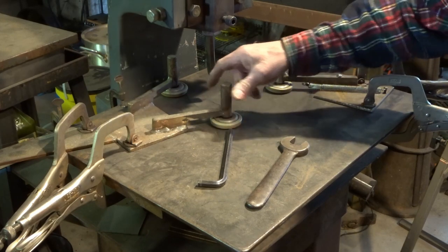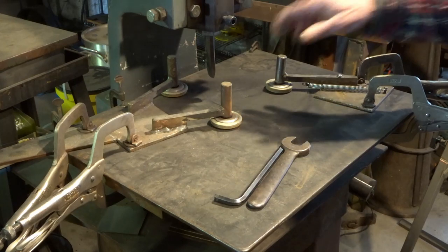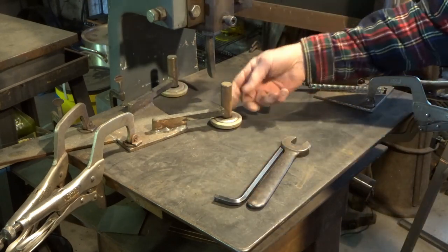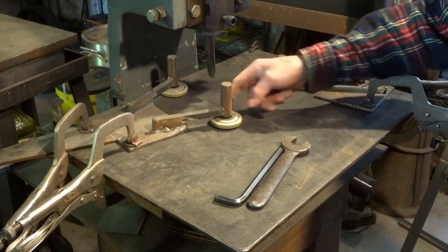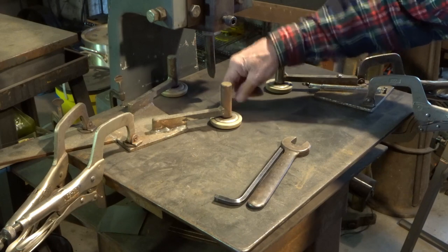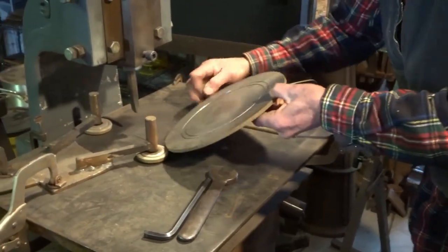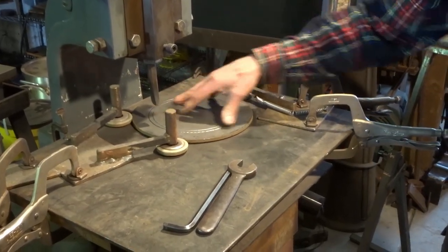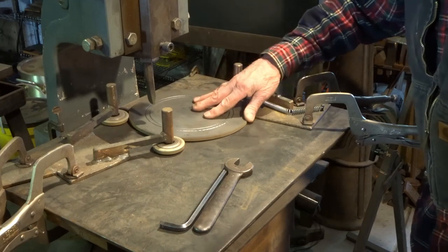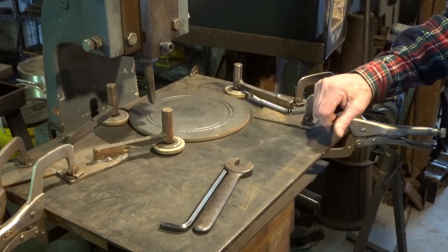These are off-feed rollers that came from a big warehouse — like 30 of these going across one roll, and they can put the brakes on it and make a box turn. That's how Amazon runs stuff around. I machined the place it pushes on through the center of the bearing, and made it so it was as close to the surface as I could but it would still spin easily. This one's basically just on a pivot with a spring, so when you put the roll in it holds it. But I found if you turn towards yourself it'll very often crawl away, but if you go away from yourself it stays — because you're pushing into the two stable fixed points, whereas going the opposite direction you're pushing against the spring-loaded point.